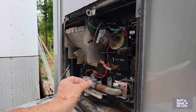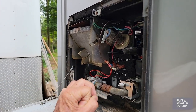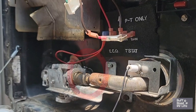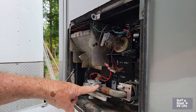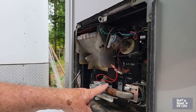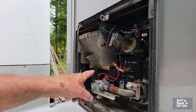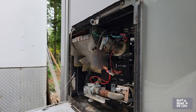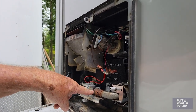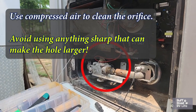There's a little quarter-inch nozzle on the orifice that goes into the valve, and it has a tiny hole that can become clogged — which it was, plugged by a little grain of sand or soot. We blew it out with an air line. That clogged orifice opening could have been what was wrong all along. So the first thing I would check if your water heater isn't working is whether that little orifice hole is clogged — just take it off and see if you can blow air through it.